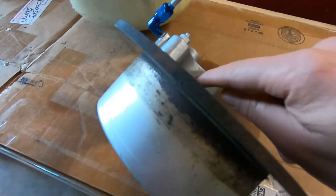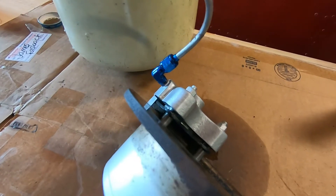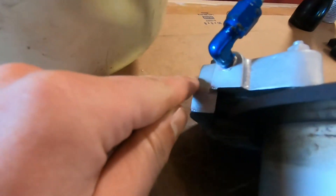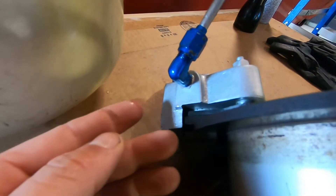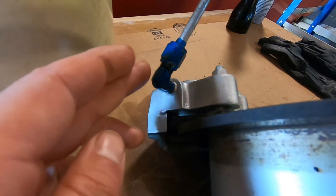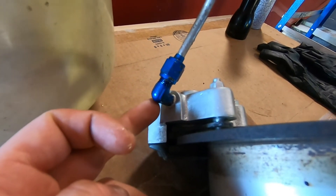What's interesting is that hydraulic leak I was afraid was coming from our piston inside the cylinder — I'd mentioned I changed the o-ring on that recently — but actually the leak is coming from the AN fitting around the top here. There's the fluid; it is leaking around there. So I'm kind of glad I did that pressure test because these are not super cheap.